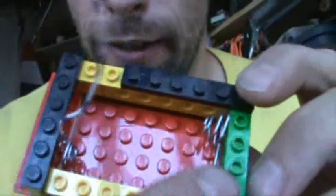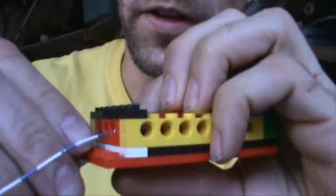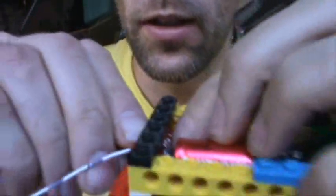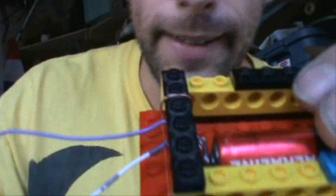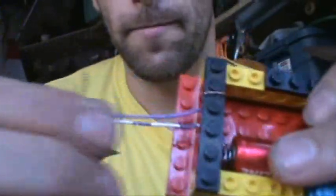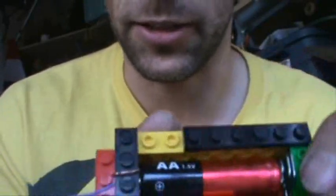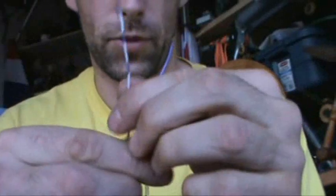So now there's a spring here and a flat here and a spring here — we just need a flat at this end. You can make that last flat part with just a long end of your wire by sticking it through here and bending it down on the inside. Wrap up over the top and back out — it starts in there, comes out the hole, wraps over the top, and comes back out. Now you've got your two wires. Stick the batteries in and they'll contact everything. Look in and see if anything's not contacting, and move stuff around. It looks like everything's good. Now just strip the other end wires.